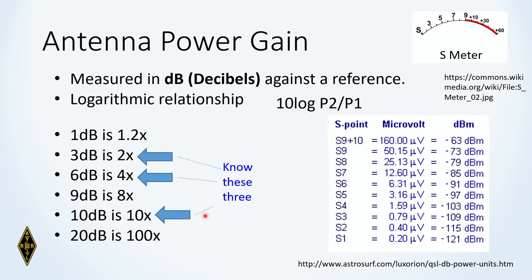And if you have a high-frequency receiver, it probably has on it an S meter, which is received signal strength. Here we have S9, and above S9, it's actually calibrated in decibels. Below S9, it's calibrated in what they call S units, and a standard S meter, 6 dB, is 1 S unit. Now, there are some variations from manufacturer to manufacturer, but that is the standard.